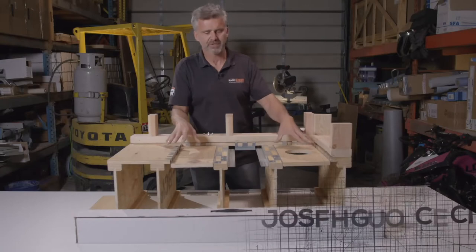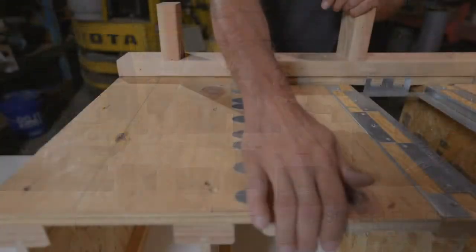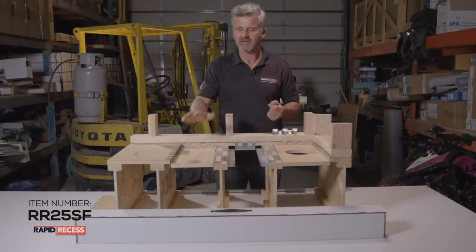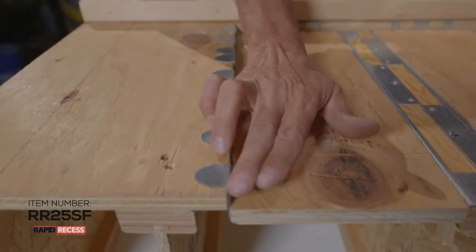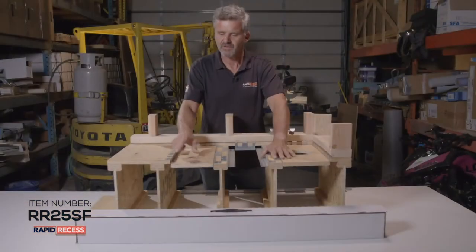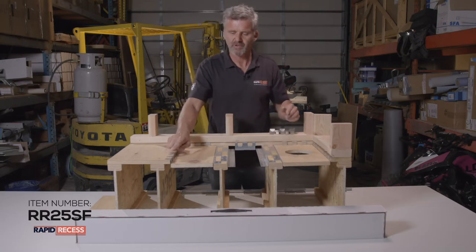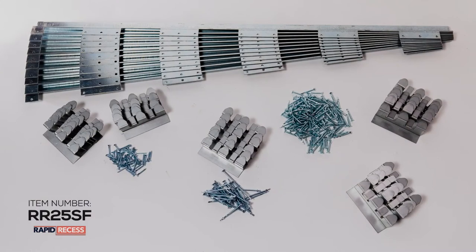This is the setup for the point drain kit, which allows you to lower the subfloor by 11 sixteenths of an inch below the original floor. The point drain kit makes this whole plane recessed by 11 sixteenths of an inch lower than the rest of the bathroom floor. We need that difference of 11 sixteenths here, at least, so that we can install the slope from the high point to the lowest point at the drain.